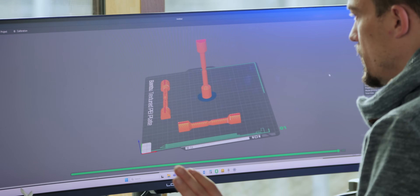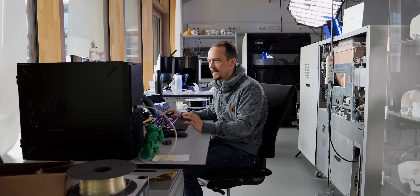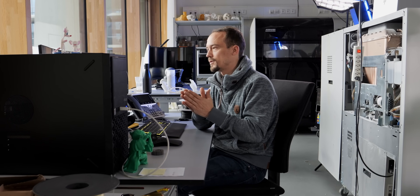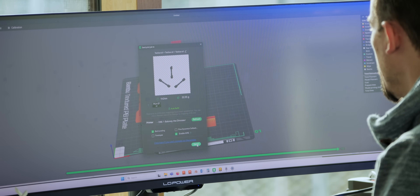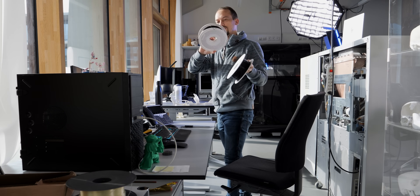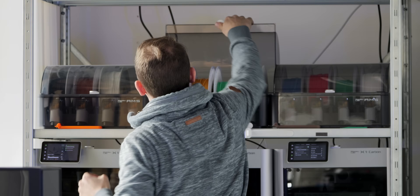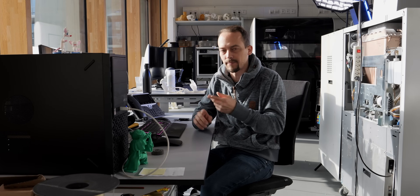We slice with standard settings — 0.2 millimeters, everything standard — PLA, print. Then I take the exact same file and simply switch to PLA carbon fiber reinforced. We took the same materials from the same manufacturer so the only difference is the carbon fiber content, giving us a good comparison. I slice again without changing positions or any other metric and send it off to the printer. Same process for PETG basic and PETG carbon fiber reinforced. These machines are kept up to date, well maintained according to the maintenance plan, because we use them a lot for research and for medical 3D prints — they are as well-calibrated as a printer can be.